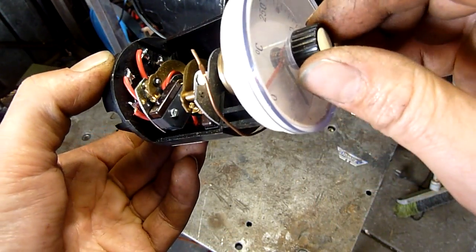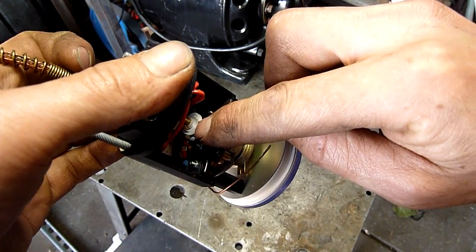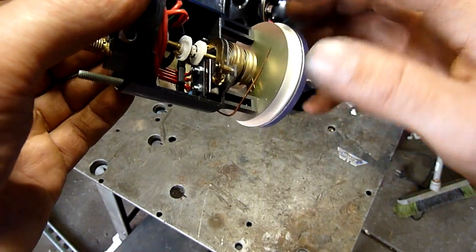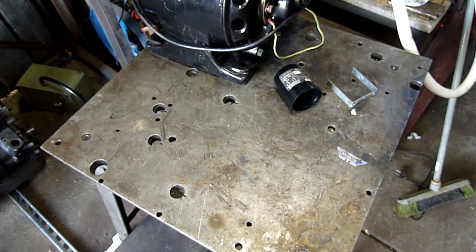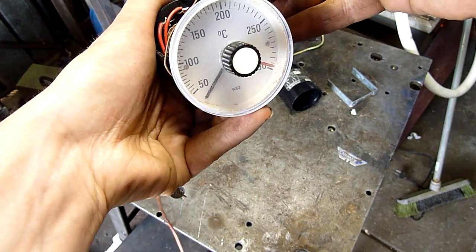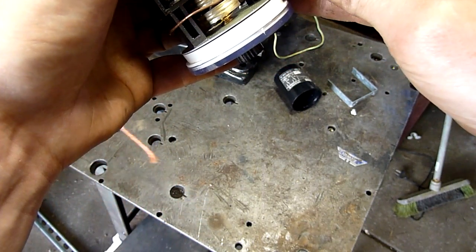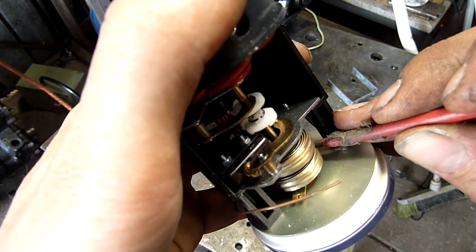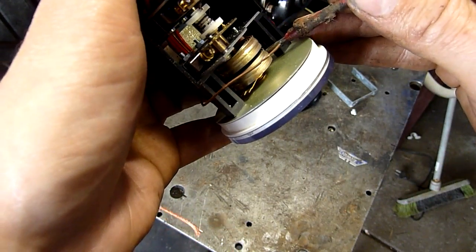When you adjust your cutout, these switches move, and these switches are aligned on something almost like a scroll or a cam. So as this internal assembly moves... yeah, so that collar there is the actual temperature needle. Let's set it to 50 - and here, because it's getting within range, it's triggering. In theory this could still be used for something, but it's not accurate as an instrument.